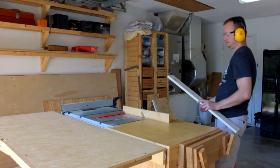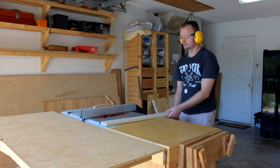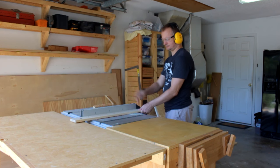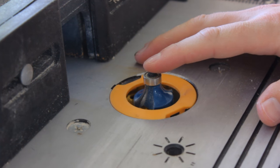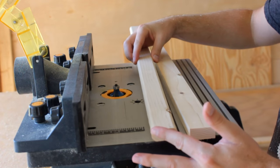While those are drying in the clamps, I'll take another board, cut it to length, and rip it into one-and-a-half-inch strips on my table saw. These will be the rack cross bars. I've set up my router table with a round-over bit so I can take a square-edged strip and round it over into a smooth bar shape.